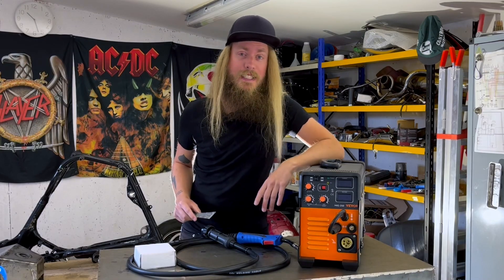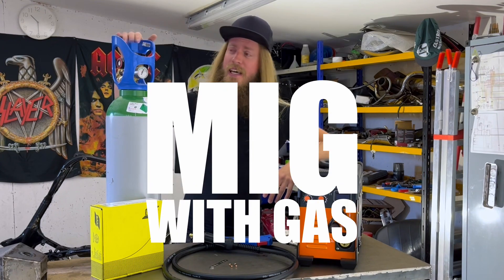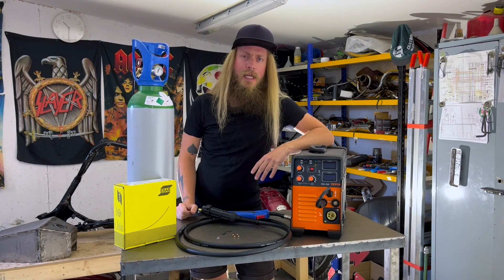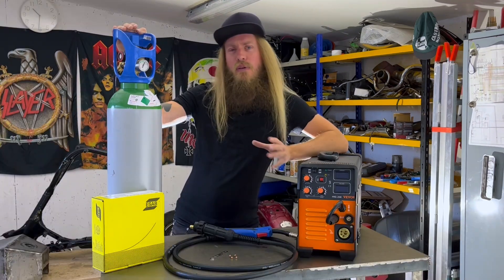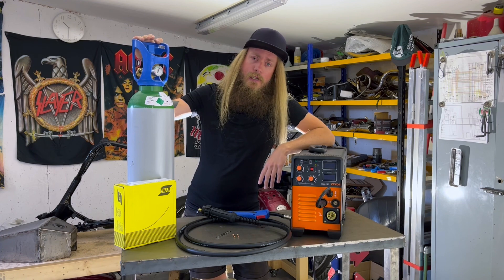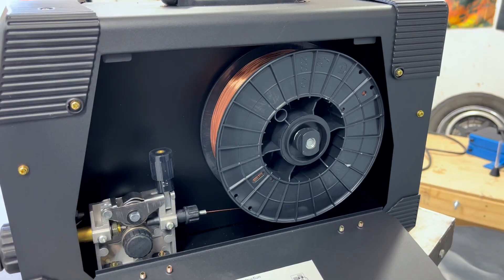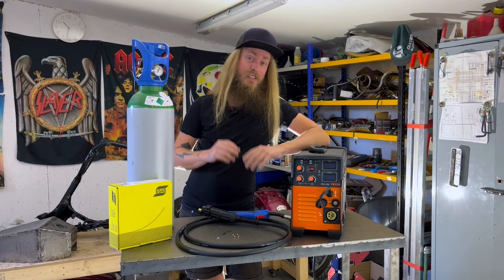Alright, let's move on to the next technique — MIG welding with solid core wire, or in other words, MIG with gas. This is where it starts to get really interesting and this is brand new territory for me. It comes with everything you can expect, but it's missing three important components: the gas, the gas regulator, and the wire. I ran Argon because that is what I had and this bottle has a built-in regulator. I also ran the ESAB OK Autorod 12.51 — still not a sponsor. The machine also supports the big 5kg rolls, which is really nice.